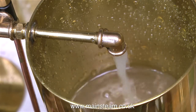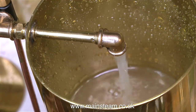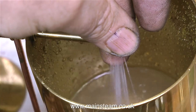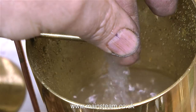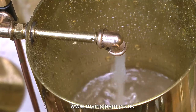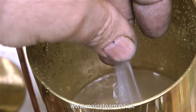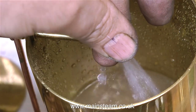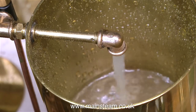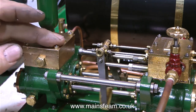Back into the workshop and the pump is now working fine. The water is running in one continuous stream as you can see here. And when I put my finger over the end of the pipe I cannot stop the pressure — there's an awful lot of pressure coming out of this pipe now, and the pump isn't running very fast. This is how things are supposed to be. How it was before was unacceptable and it wouldn't have got any better — the valves were firmly stuck in place by the silicone rubber. Fixing the pump like this is a bit above and beyond the call of duty, but I am assembling a high quality steam plant and I really couldn't put the pump into the steam plant with this amount of silicone rubber in it.